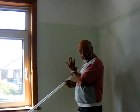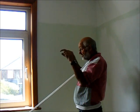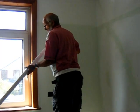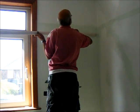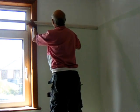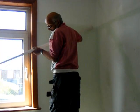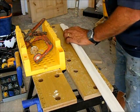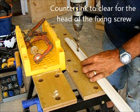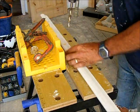You start on the farthest wall working back to the door, so scribes are cut so your eye sees the scribe going against the farthest one. I like to do everything not by measure but by sight. We'll mark it off and just cut that one square. When it's cut and ready to fit, we then need some countersink holes to take the head of the wood screw, at about 400mm centres.